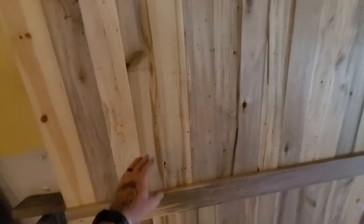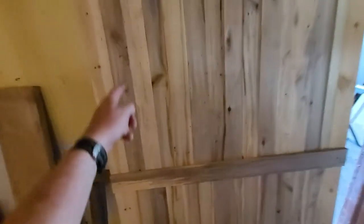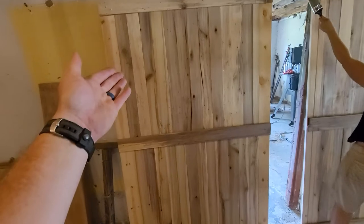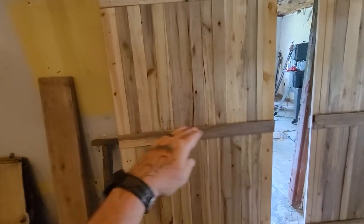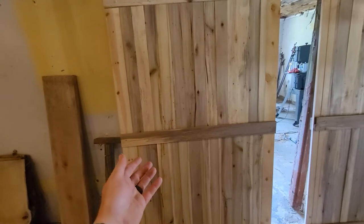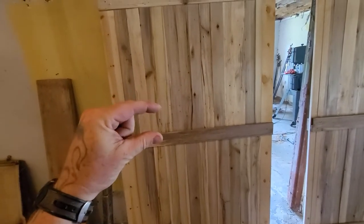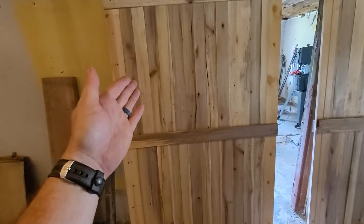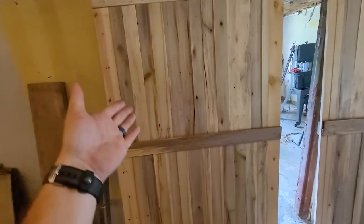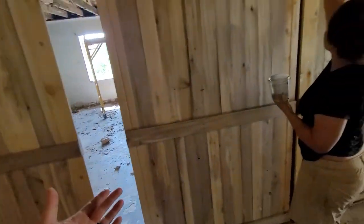The rest of the wood is cut right here in the middle — they're not full length. If they were full length we would have had the same problem with them bowing tremendously. Every time you cut them shorter you're taking the bow out; the shorter the piece, the less of a bow it can possibly have. Then we ran them through the jointer to get them as straight as we could, and they came out pretty darn straight.